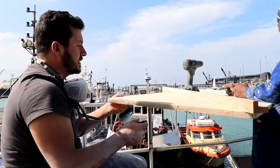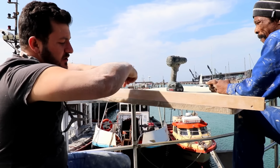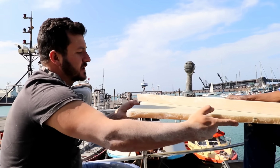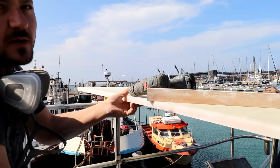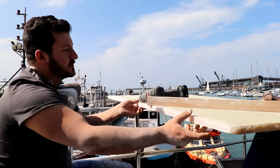So what I'm doing now is I'm putting the straight edge up against it like that, screwing it down, and then I'm using the router to route it down to get a perfectly straight edge. When we're done, after routing it, that's what the edge looks like. There are other ways of doing it. I suppose I feel maybe this is the quickest, I don't know.